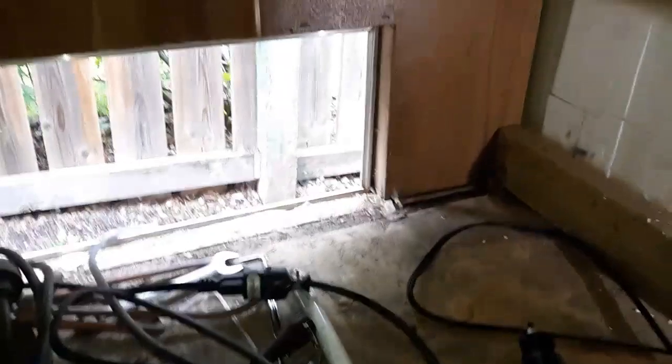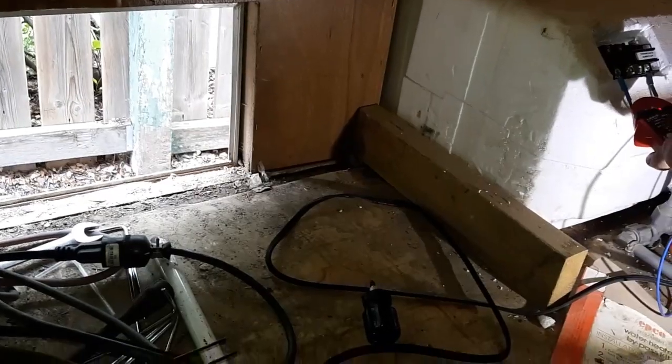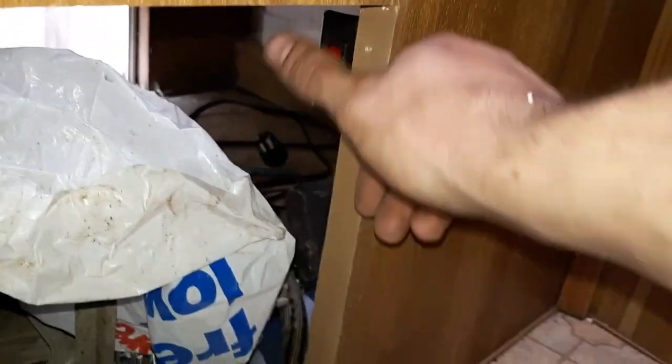I should have power on that blue line - why don't I have power on that blue line? I'm going to do some diagnostics. Alright, so I found out - I'm getting power now, and now I'm not, now I am. I found out that this cupboard door makes contact just enough to kill the switch. So I'm going to have to figure out a different spot for that - probably just rotate it sideways. As easy as that, I'm just going to move the power switch elsewhere.